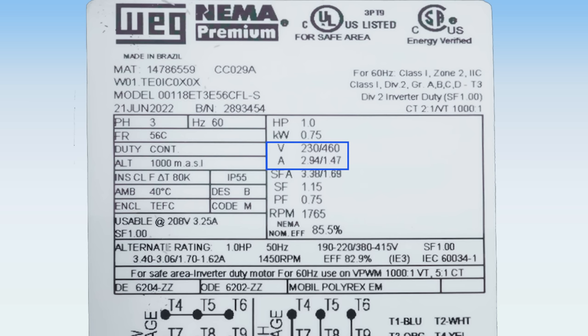Keep in mind these are nominal voltages and your system might be 115, 240, or 480 — and that's fine. If you have 208 volts, this may also be shown on the nameplate or you may need to check the motor specs to verify it's rated for this voltage. You'll notice current listed here. There's a slash between the two current numbers just like between the voltages, indicating these numbers are matched to the voltages. So this motor will draw 2.94 amps at 230 volts and 1.47 amps at 460 volts. These current ratings are always full load amps, or FLA.